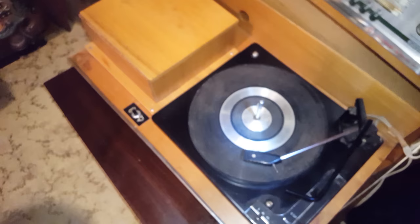But yeah, I'm going to try to flip this over somehow. I'm wondering if that isn't the problem. One sec. I'm wondering if that's just not the problem, since it is indeed pretty frayed. Definitely some broken connections in there. So that's definitely going to be our first fix. So I got to go find my soldering iron.